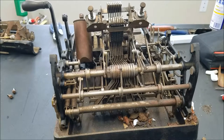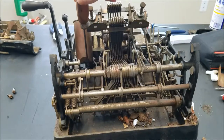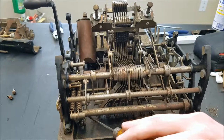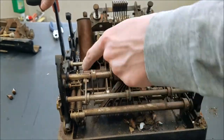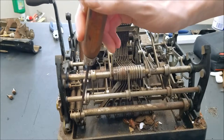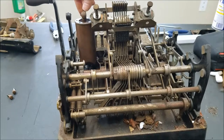I've managed to get this shaft to rotate a bit more. This guy right here — that's what was stuck before. It's driven by this lever down here, which is attached to a piece around this shaft and driven by these springs. Basically when you pull the handle, this end of the springs moves with this shaft, and then the springs pull this lever which drives the shaft up front. It looks like part of the problem is this dampener — so that when you let go of the crank it doesn't just snap back. This is supposed to provide some drag. Well, it's really providing drag now.